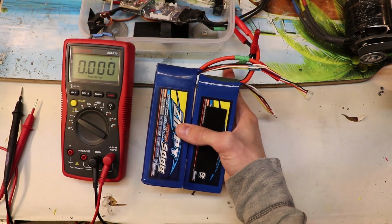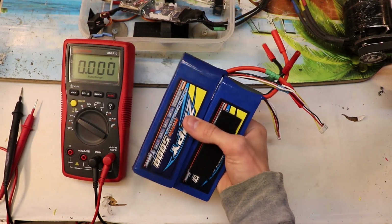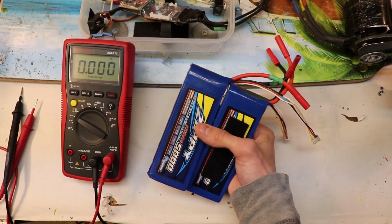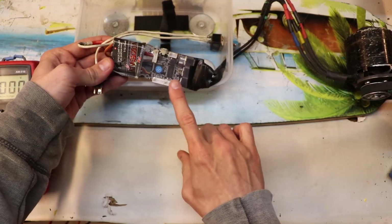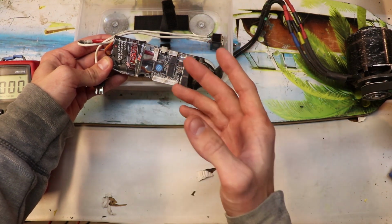You could get longer ranges with your board if you sacrifice your cell voltages and just discharge them more, but like I said, it's risky. So I'm very glad I programmed this in the way that I did, because it does save your batteries.